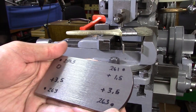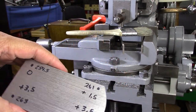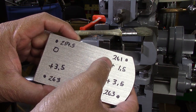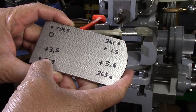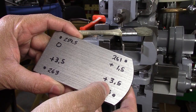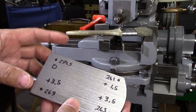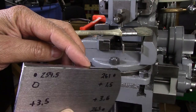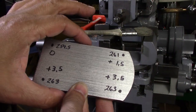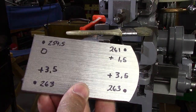After a little cleanup, the surface was sitting like this: a thou and a half high on that side, three and a half down here, and similar on the other side. These pieces are round on the edges, so I'm going to square up the top and bottom. Hopefully that'll let me hold the tolerance a little tighter.